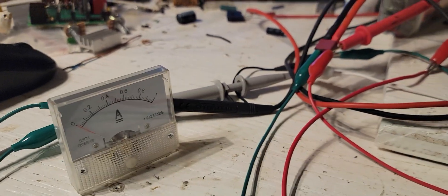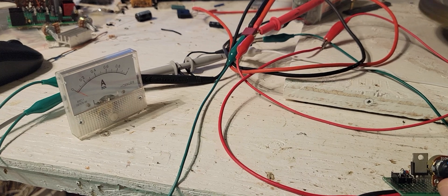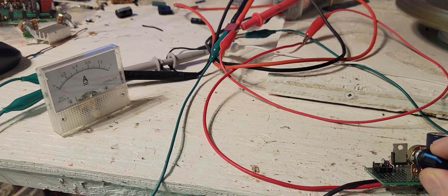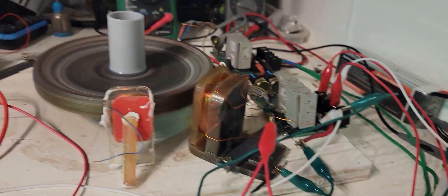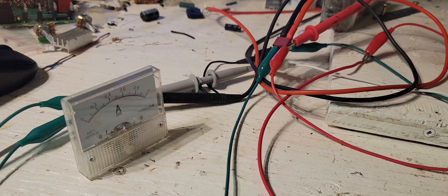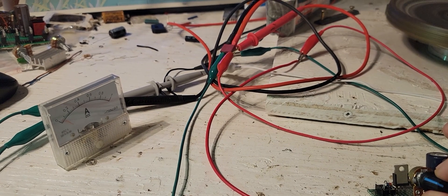It's firing only every 3 seconds or so right now. If I turn this counterclockwise, it's gonna start firing at a lower voltage. Turn this down - see it's firing pretty steadily now. You can hear the motor speeding up and it's using a little more current, but the motor is speeding up quite a bit because I'm taking that vacuum off the motor at a lower voltage. I'm still turning it down some more - you can see how fast it's firing now.